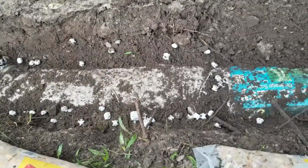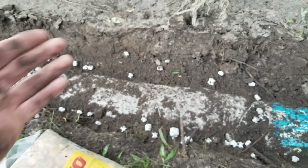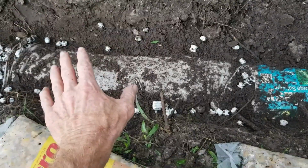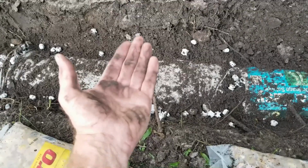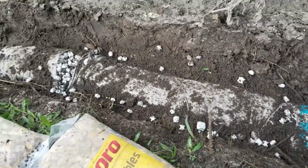However, especially here in Florida, these systems double. They do two jobs. We can collect surface water by adding gravel, letting the water go through the aggregate down into the perforation. It still goes down to the bottom of the pipe and floods upward, but it will work just fine. It's just going to help pick up more water faster.